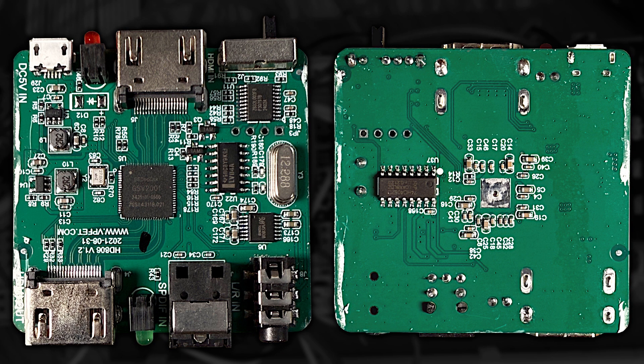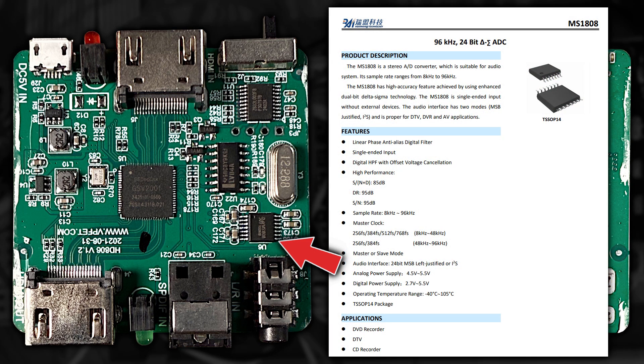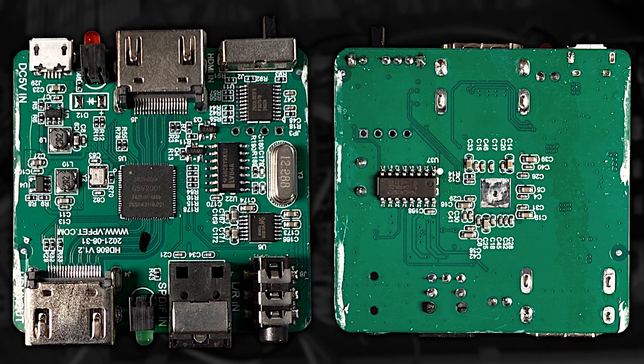But now we get to have a look at what's inside. I'm not planning on reverse engineering this totally but I just wanted to look at what some of the chips are doing. The big one in the middle labelled GSV2001 is doing the grunt of the work and it's surprising just how many things it supports. I'm wondering if someone in the future may consider integrating this into an RGB to HDMI board. This chip here is a stereo analogue to digital converter. This one is an analogue switch. And finally this one is an ARM Cortex 32-bit microcontroller. The reason I wanted to remove all this from the box is that on the Amiga 500 there's a small space under the internal floppy drive — the space isn't tall enough for the entire box but it's big enough for just the PCB on its own, and once removed it's really easy to get installed there.